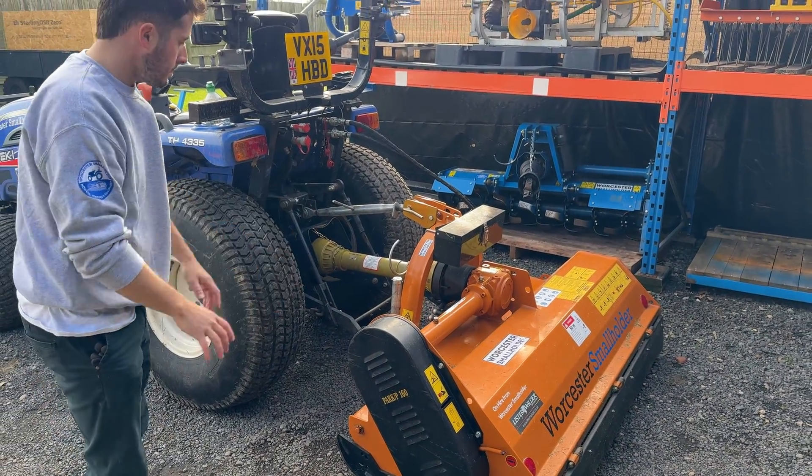There we go. I'm going to hook that onto there. Now when I reverse back up it's nice and straight and hopefully won't catch on the bar. The machine is now completely detached — nothing's connected anymore. The chain's off, hydraulic hoses are off, both rear link arms with the quick releases are all off, and our top link is out of the way. We haven't had to take out any of the pins — with these quick releases, you don't need to. They can always stay in. It's really fantastic. And that is how you detach a flail mower. Thank you for watching.